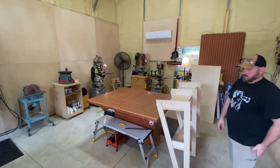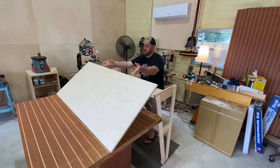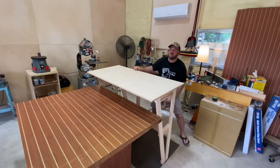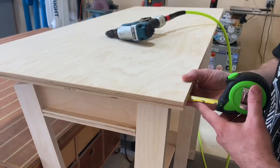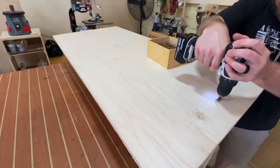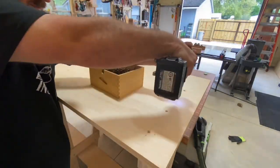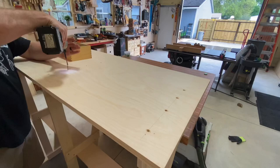With the piece turned upside down, it's now time to install the base. I'm going to use some Jedi mind trickery here to kind of pull this back in place — there's probably a Star Wars joke in there somewhere, but I don't want to force it. Now it's time to make sure the whole piece is exactly where we want it to be, using a tape and making sure I've got even spaces all the way around. I've made some marks and I'm going to take a countersunk bit, drill four holes, and countersink some two-inch screws all the way down.